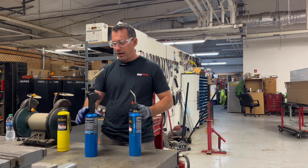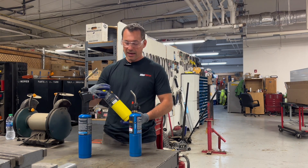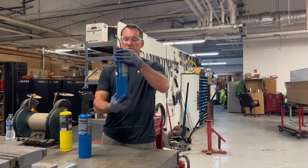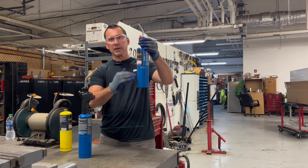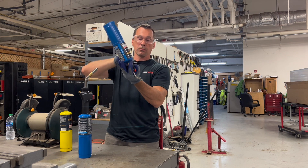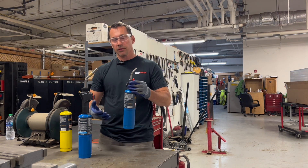The first thing I want to point out is the fuel source. All of our torches run off of propane or propylene, and these are liquid fuels. What that means is that when the torch is in an upright position, the liquid — like in a water bottle — is going to be in the cylinder and not in the torch. But when the torch is inverted, the liquid can now pour into the torch, and this can cause issues depending on the torch model.